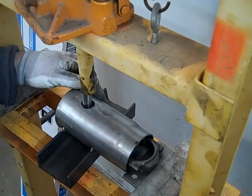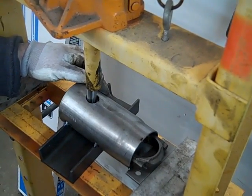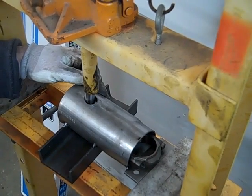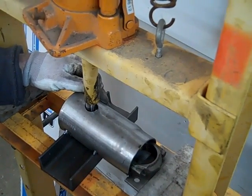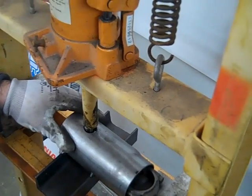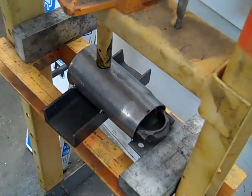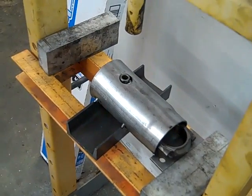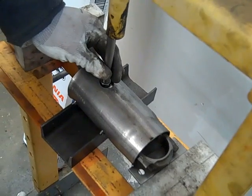I'm going to start to push through the rod. That's just perfectly how it's supposed to go through right there. I'm going to turn it on without any heat at all. The heat just distorts and screws the rods up. I know it's a fast, easy way — people have been doing it for a hundred years that way, and they should have stopped about a hundred years ago.